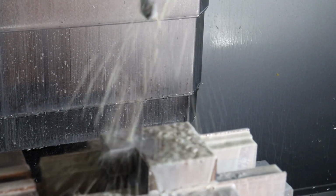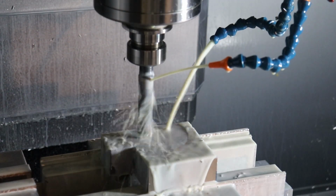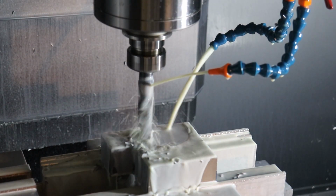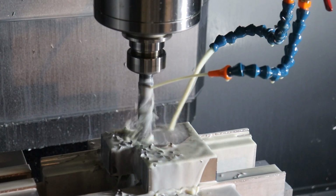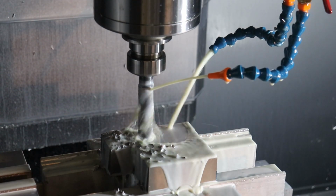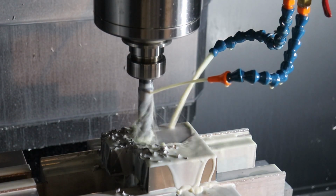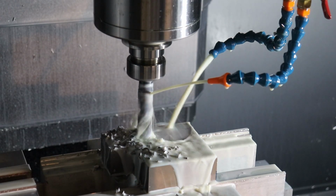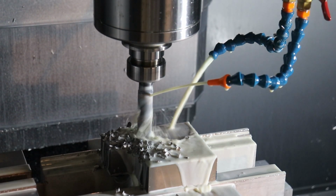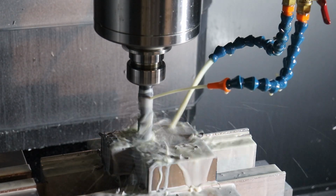So this is a 3/4 inch drill, and obviously I've reduced its RPM because this is probably going to be a pretty nasty heavy cut. Whew. Getting some chatter. The spindle's running at about, there, it started cutting better.